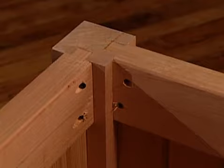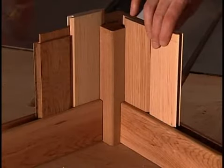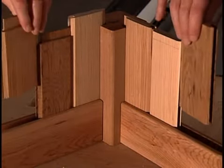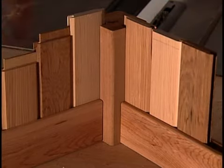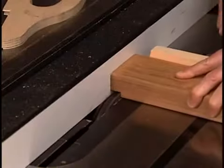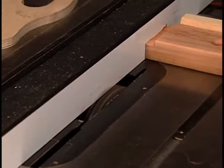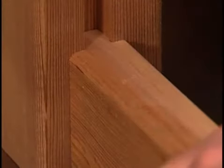The storage box is made up of one 8-foot 4x4, milled down to 2 3/4 inches. Each post has 5/8-inch dados cut into both sides to receive the side rails and the tongue and groove slats. The 3/4-inch slats are held in place by these dados. The rails are made of four 8-foot 2x4s. Each rail has 3/4-inch tongues cut into the ends to insert into the posts.